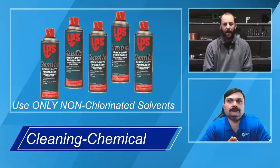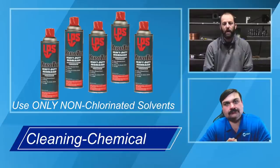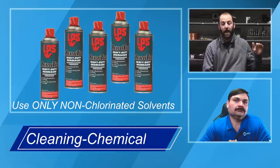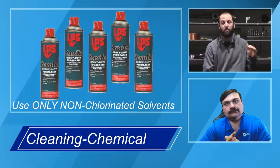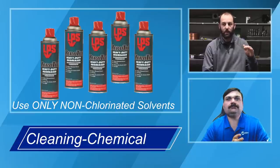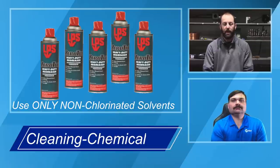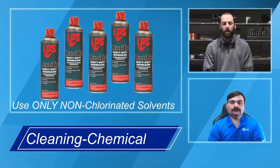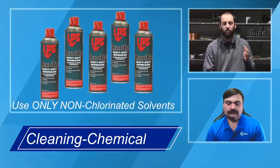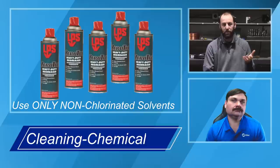But if you think about oils or wax, as they get hot, they tend to flow or wick along the surface because of the nature of that material or compound. Even if you clean an inch back, as that piece heats up, you'll actually get, I don't know if this is the proper term, a capillary action of that oil in the surrounding weld zone. It could get sucked or flow across the surface of the material and end up in our molten weld pool, and cause issues from getting in the actual molten welding pool, or get extremely close and then boil or vaporize and cause issues with our shielding gas stream if it's a MIG or TIG welding process.